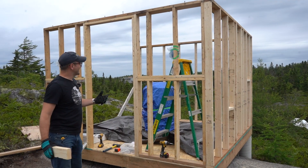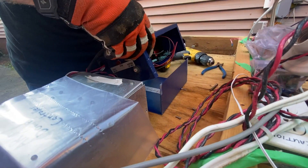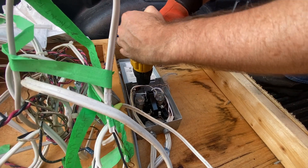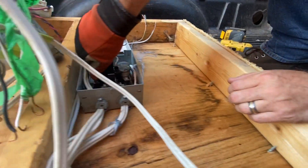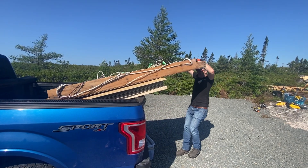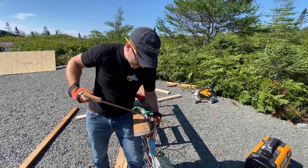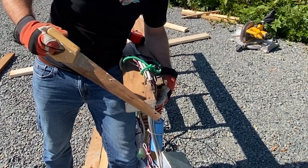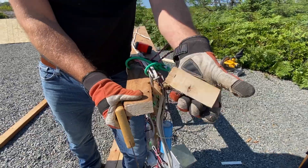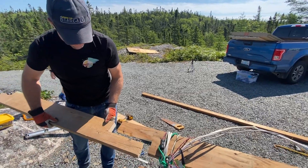We got our walls in for the day. The next step, we've got to put on our missing wall, which has all the electronics in it, and then put on the siding. These are like the old house fuses. We're super carefully cutting out around these wires because this top plate is rotten right here. So we'll cut some grooves and fit a new board in to lengthen this, because it needs to be 125 and a half inches total.